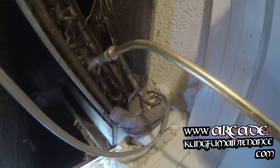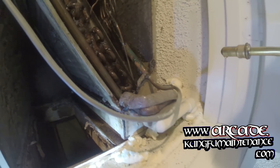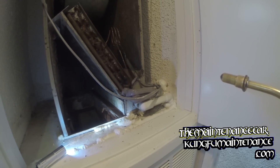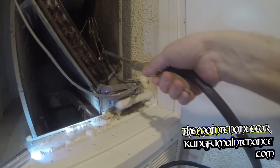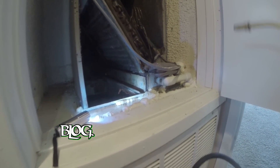Sometimes the soap is enough to see a small leak. If you have a small leak, you can watch for any bubbling up on the coil. Spray some in the pan too, and we can just keep everything clear and clean.